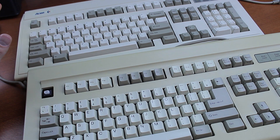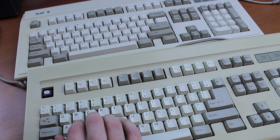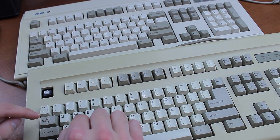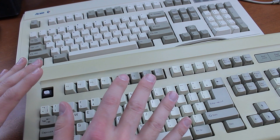One final note: if you haven't tried them yet and you want to go blue Alps, it's probably best to get a white Alps board first and see if you like them, as blue Alps are basically the same as white Alps but just a bit more refined. If you don't like white Alps you won't like blue either, and if you do you will — and besides, white Alps are much cheaper and easier to get hold of. So before you splash a fortune on the blue ones, have a go at the white ones first. That said, as always with Alps, whatever board you go for, make sure it's super clean. I just can't overstate how much of a difference having a pristine board versus a slightly dirty one makes when it comes to Alps switches. You have been warned.